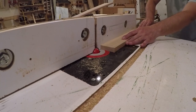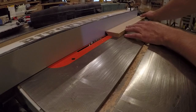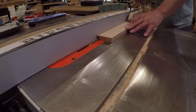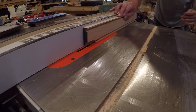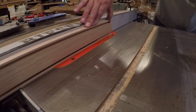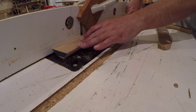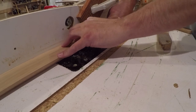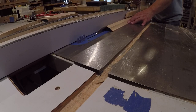Now it was time to make the cove. I just routed the tip of the board so I could get the profile. Then at the table saw I used the dado blade to remove the bulk of the material. This reduces the load on the router, saves time, and reduces the chance of blowing out big chunks of wood while routing. I ended up doing a horizontal pass and a vertical pass to remove most of the waste. Since a lighter pass at the router typically produces a cleaner cut, and it's safer to route a bigger piece with less chatter, I used a wider board than I needed and routed a profile on each side. Then back at the table saw I cut the cove free.